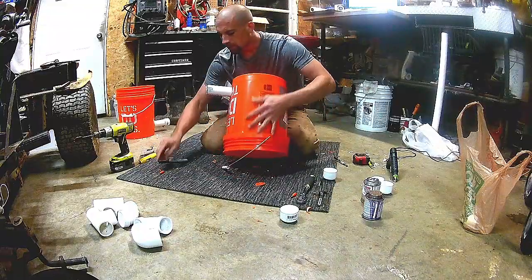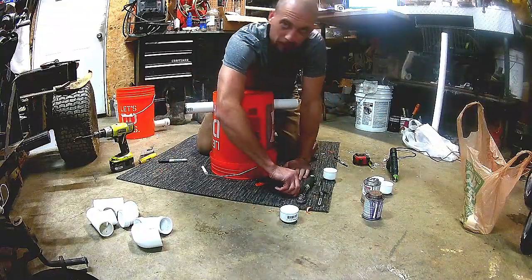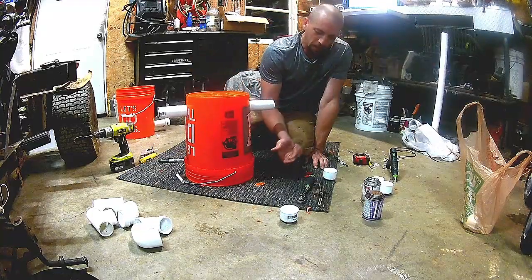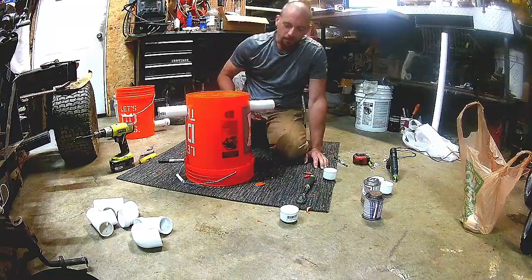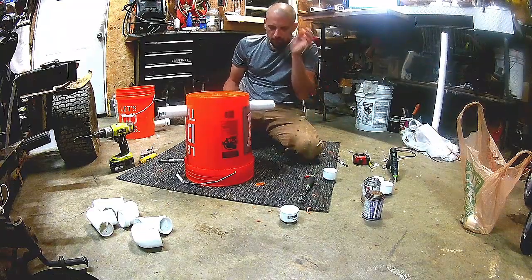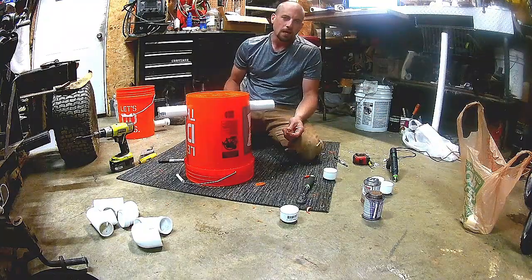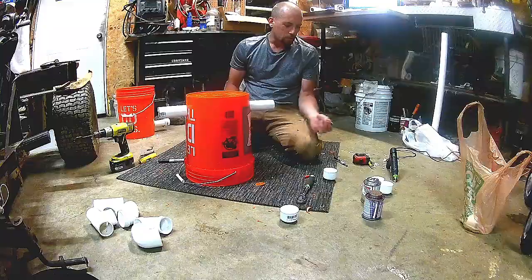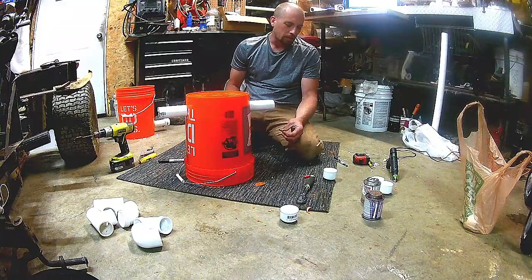For the nipples, the ones that I've got, I'll throw a link down in the description. Really easy to use. You don't have to do any crazy taping or anything if you don't want to. They're supposed to self-tap. Me personally, I have taps, so I'm just going to tap it regardless. This one uses an 11/32 drill bit.